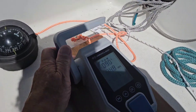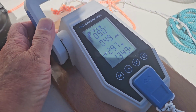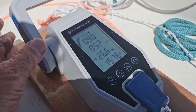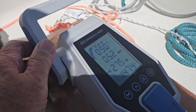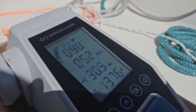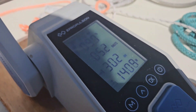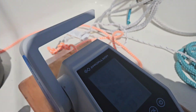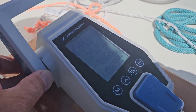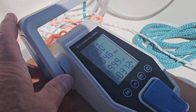That's about one-third of the full speed capability of the motor. Let's go up a little more. As we increase engine RPM and current draw — we're at about 1,500 watts — you can see the speed doesn't really increase much. We've pretty much hit hull speed. We're pushing harder and going 5.2 knots, but that's not much faster than 5 knots and we're using 50% more power. So that's not the smart thing to do — I really don't think there's any reason to go over 1,000 watts.